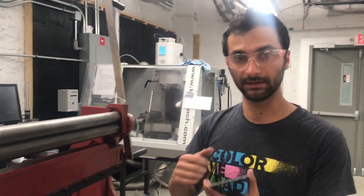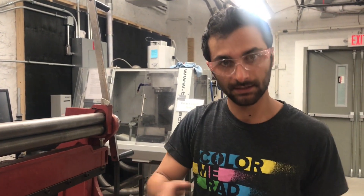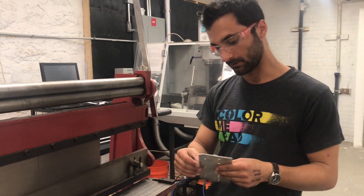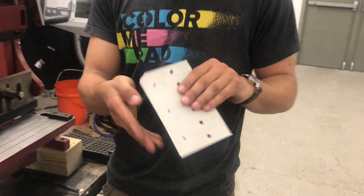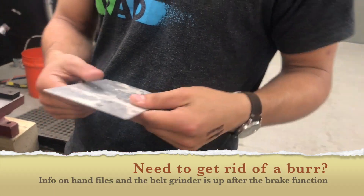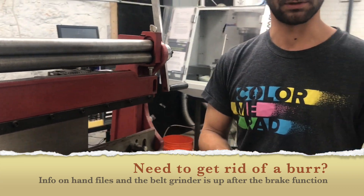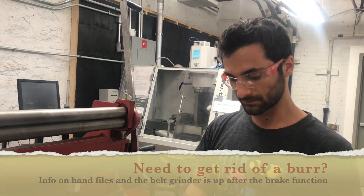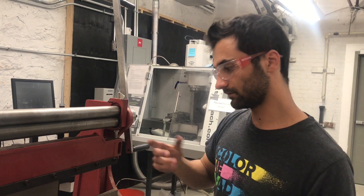If you find yourself really heaving on it, then you probably want to find a different tool. This looks like a good cut — it doesn't look like it was smushing or anything bad like that. There's going to be a slight burr on one side. A burr is just a little rolled-over piece of metal. So before you were to use the rollers, you would want to make sure to get rid of that burr so you aren't leaving little grooves in the slip rolls. Even though it is aluminum, that little fine burr could get in there.